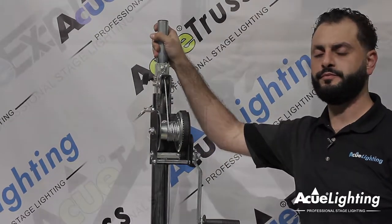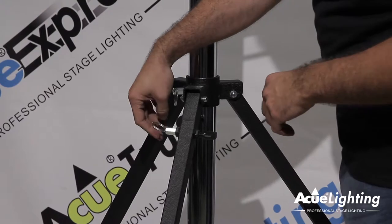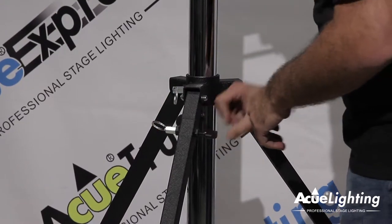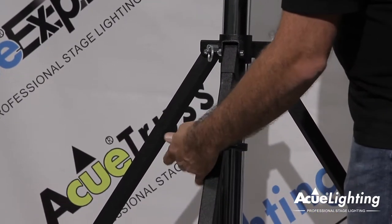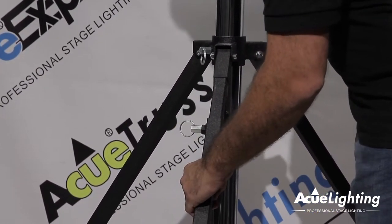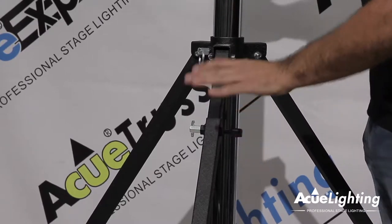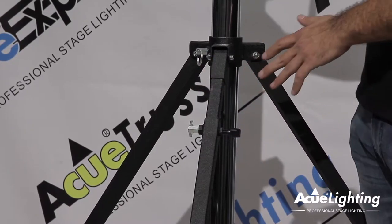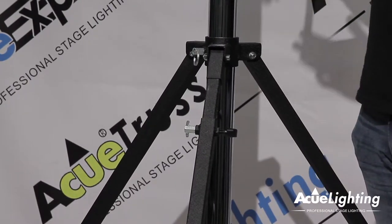Now it's safe. When you're on uneven ground, you pull out the pin and release the tightening screw, and you can tilt it back and extend the leg out however far you need. You have a couple of different options to lock it into place depending on what degree you want to set it at. You can go ahead and lock it in place once it's on uneven ground. Once you have everything leveled, you can go ahead and start lifting up your load.